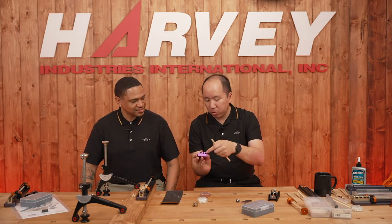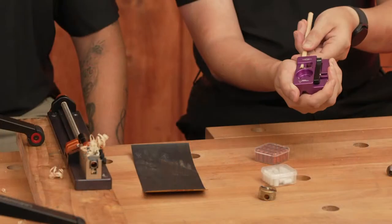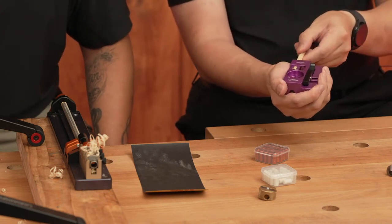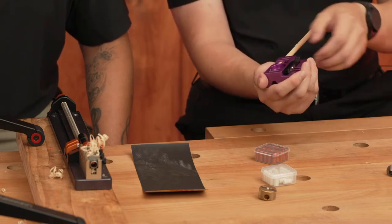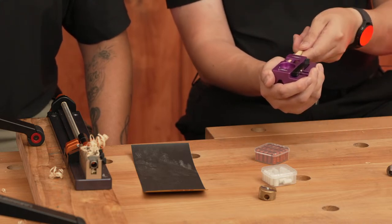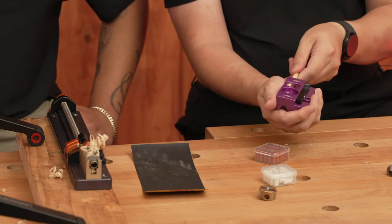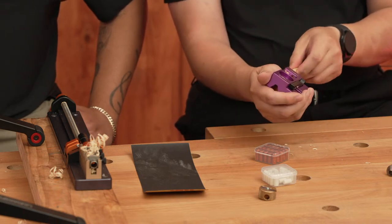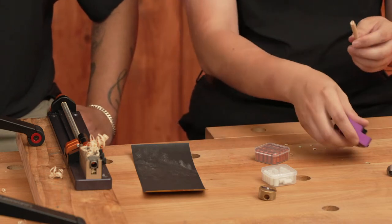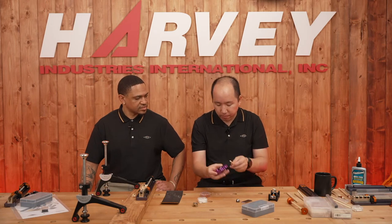So going to this side, you'll install the pencil into the smaller hole in this case and push the pencil up where you cut, like so. You'll remove a little bit of material. Rotate it, push again, and you'll remove a little more material. See how the scoring line gives you that clean cut? It gives you a border on where you need to stop. It's a stopping point for the piece of wood. And if you did this all the way around, it will cut away the material to allow you to fit the ferrule.